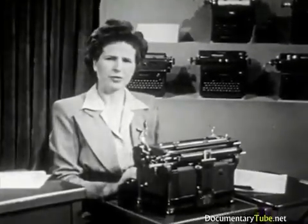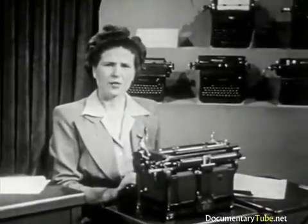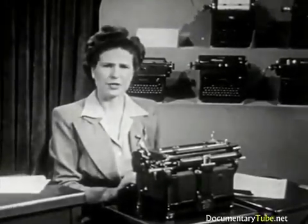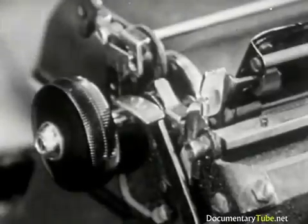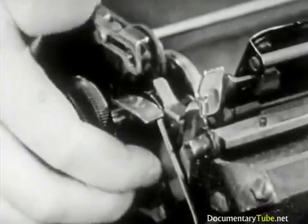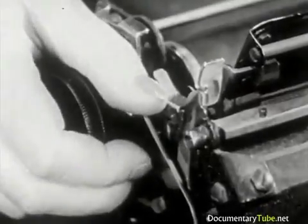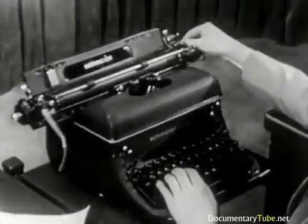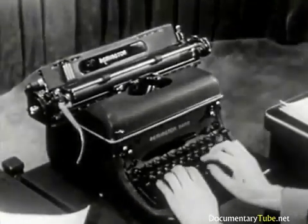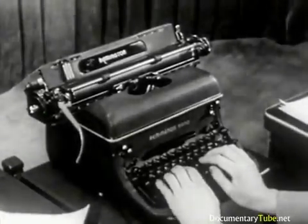It bothers other people, wears the line space ratchet and gears, causes carbon paper smears, and rubs the paper sizing into the platen, making it glossy and causing paper slippage later. The carriage can be moved to the right or left by holding the platen knob with your fingers and pressing the carriage release lever with your thumb. Machines have two carriage release levers, one at the right and one at the left.